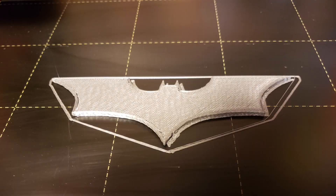But I noticed that down near the build plate, it had a layer shift, and it was significant. Looking at the points of the ears, you could see it had four ears. I thought that was probably because I was fiddling with the Z-axis while it was printing. So I cleaned off the plate and printed another one, just letting it print with no fiddling. It came out and, yes, still had the layer shift. And it still had that gap between the outside edge and the rest of the layer. So the Z-axis didn't fix that problem, and it seems to have caused a new one.